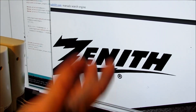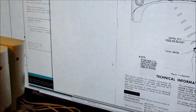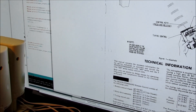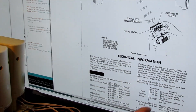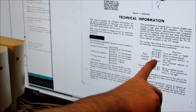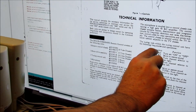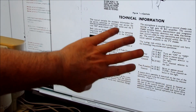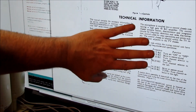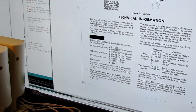There is some documentation online for this entire system - the Zenith Space Command Service Manual, not too hard to find. When I pull it up, it actually gives the frequencies for up to four different bars. Later on, maybe I'll come back and actually try to run a Goertzel filter - which is basically running single buckets of a discrete Fourier transform - to pull out those specific frequencies. But we're good for now.